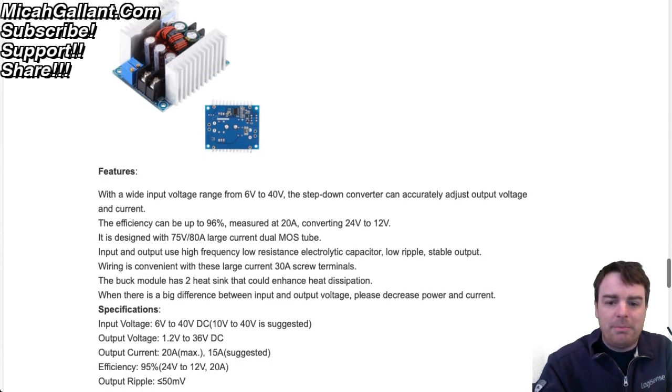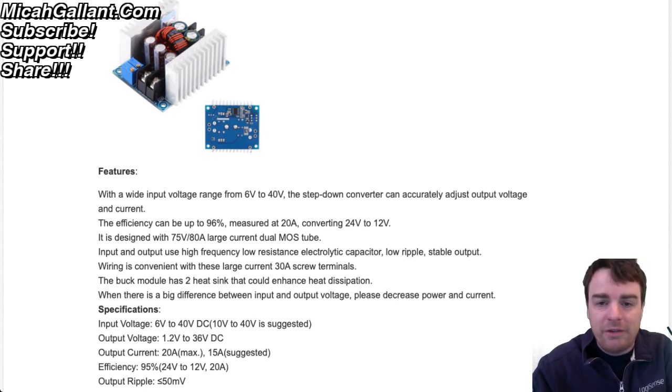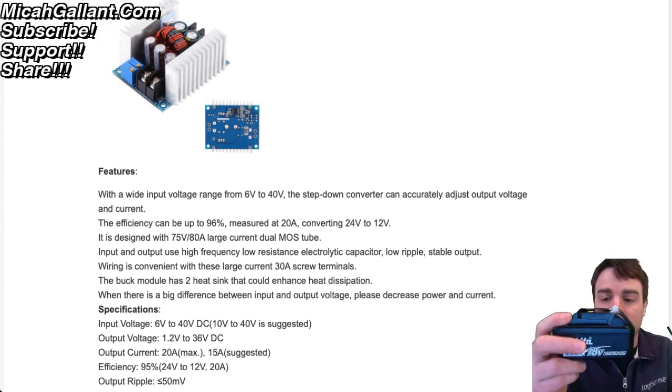You can step it down from this particular one, 24 volts to 12 volts. But these units are basically infinitely adjustable with the two potentiometers on there. You can dial it up and dial it down to whatever voltage you want, and then just regulate how many amps you're pulling out of it. You can't get a huge amount of amps out of it. This one maxes at 20 amps. But that being said, as long as you're not trying to use a 2400 watt inverter off these, it's going to be absolutely fine.